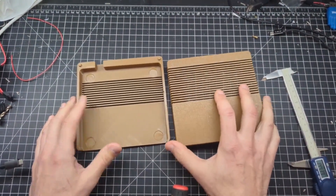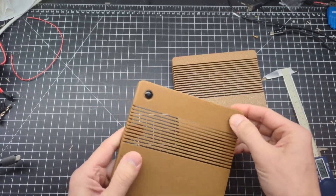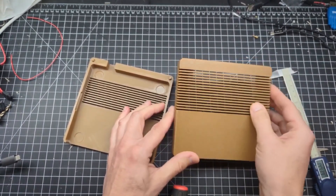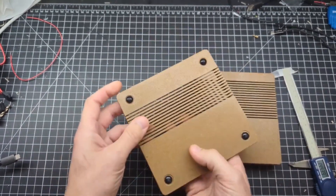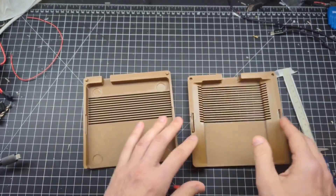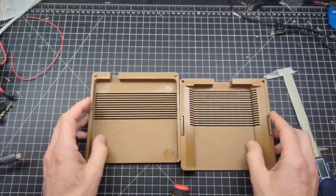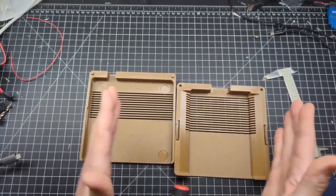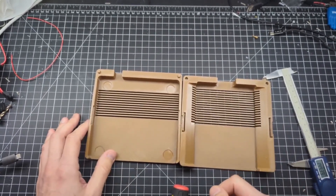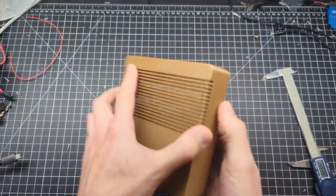This printed off fine. I put the rubber feet on there — made some spots for the rubber feet to go. There are a couple things I don't like. I didn't put any supports between here. I did want to make it vented so things could go through, but after looking at the Commodore 1541, I'm like no, they don't have vents on the bottom like this, so I could probably get rid of those. I put some angles here so it's a little bit easier to slide when I put the top on. It also saved on material usage. And I put some locating holes in here, so if I pop this together, it actually stays — it doesn't wobble around, unlike the other one.